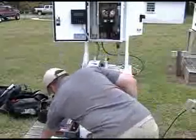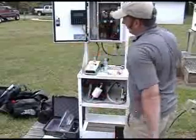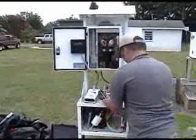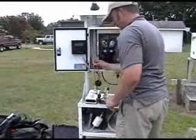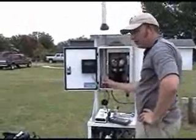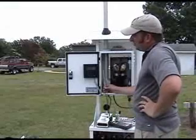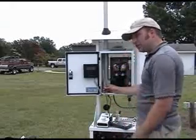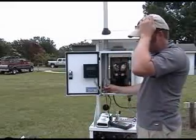I'm going to use my Eutechnik's digital thermometer for temperature calibrations and verification. When doing calibration verification outside, it's best to keep it in shade and out of the wind. Overcast days are ideal. Wind can make it particularly difficult because the Eutechnik's has a much faster response time than the instrument — my reference keeps up faster, so it's hard to get them in sync. Sometimes I end up doing the calibration twice to get it right.